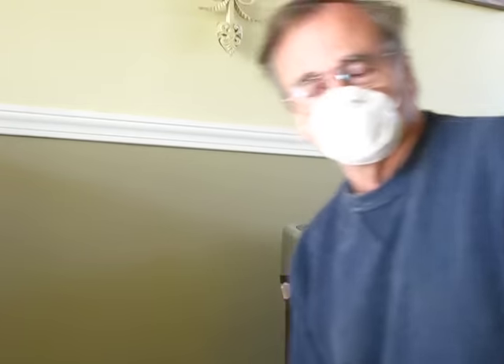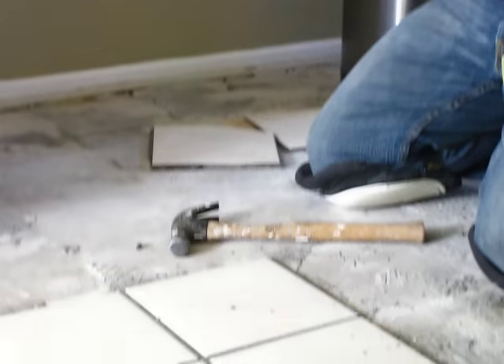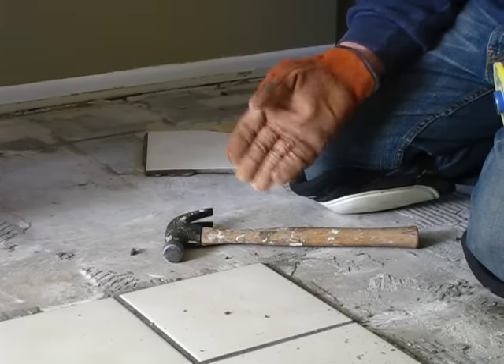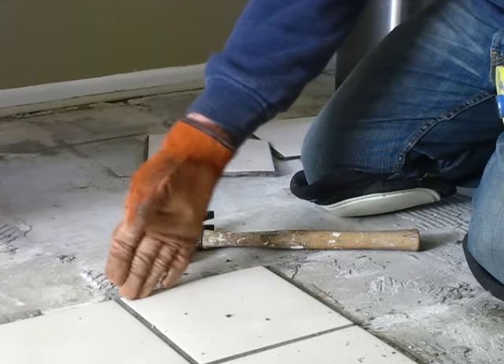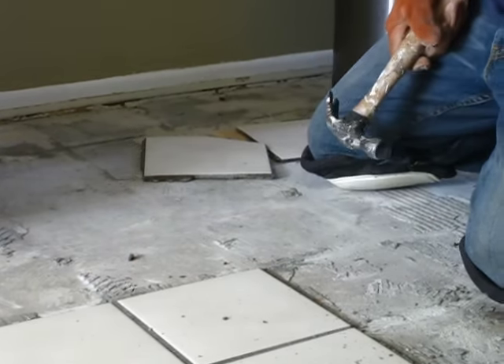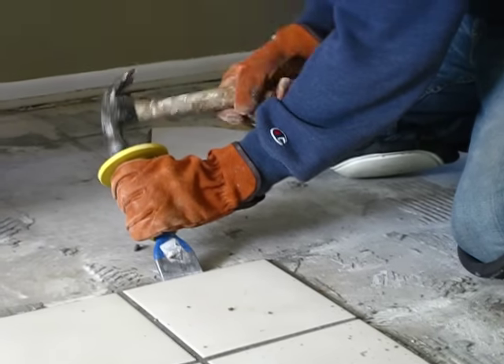You find a good starting point. If you haven't tried to take anything off this floor yet, you want to get to where the rug meets the edge, or some other flooring meets the edge of this flooring. You take the edge of the chisel and you start hitting it.